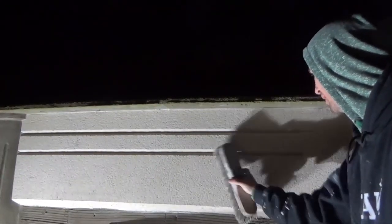Again, when doing this, just give it a gentle brush down, make sure you get all the crumbs out, as with K-Rend, them crumbs on the floor, that dust that's scratched off, will set rock hard, just like screed does, guys. It's the same concept. It's a moist mix that, when given time, will set really hard as a rock. So you don't want to be leaving all the crumbs inside the V cuts. You can see that one there, look how messy it looks. If I left that without brushing it out, it would set hard and would ruin the whole sharp edge of what the ashlar cutter from Refina actually achieves.